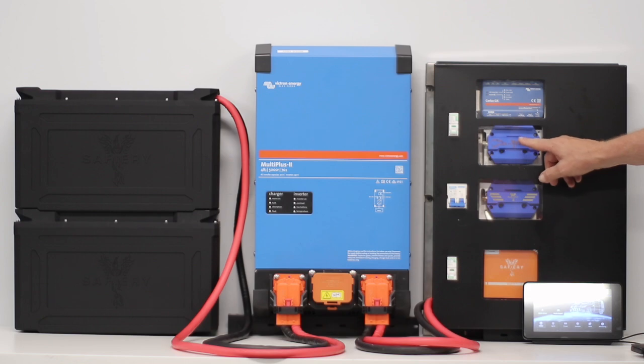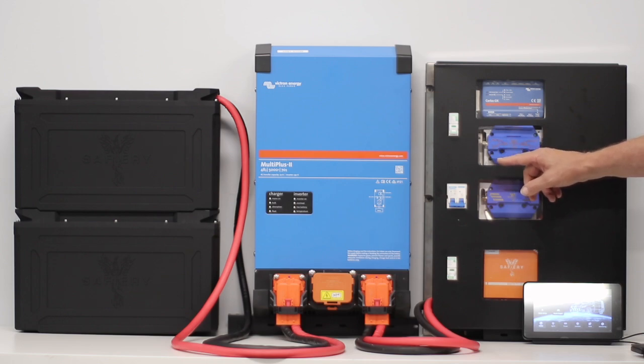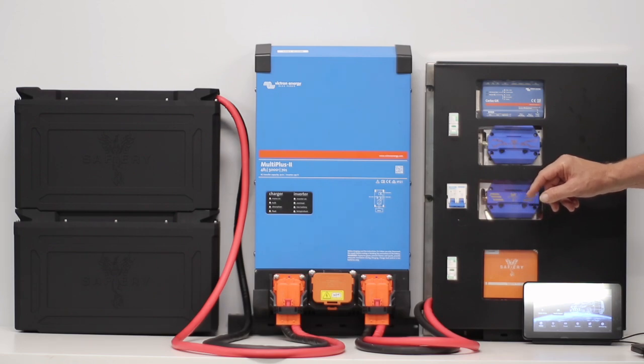An option here is to have our Star Power. Our Star Power is 150 amps max with 30 amps per channel, so it's quite capable. It'll run a single compressor directly in a caravan, it'll also run a 12-volt oven, and it can peak at well over 50 amps for a short period of time.